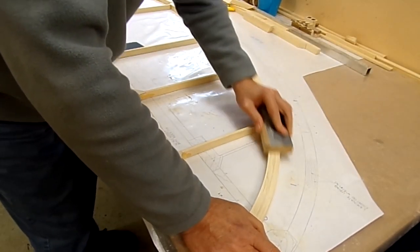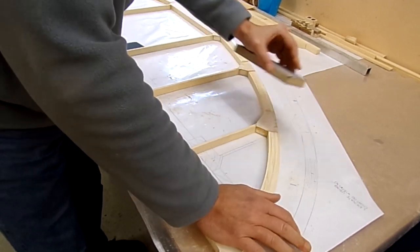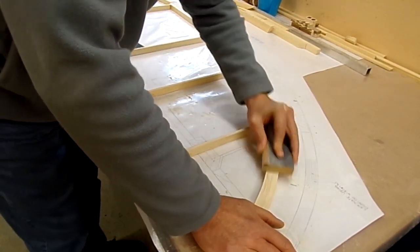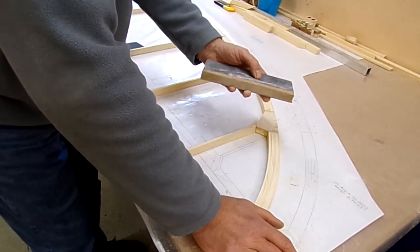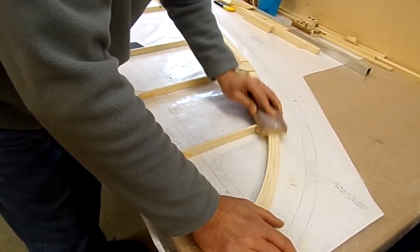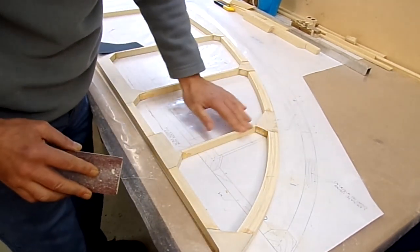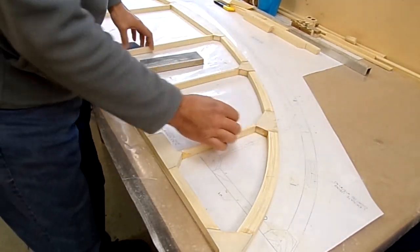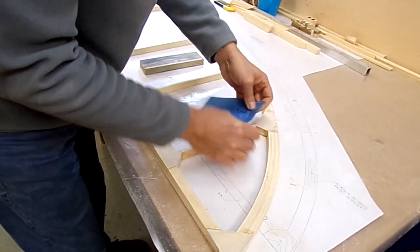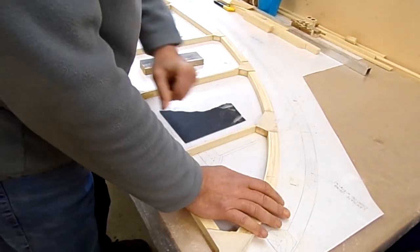Here we go — the other side, all done. I've done the edging with the router, and I'm just sanding down at the moment with 80 grit. Once I'm happy with that, I've got 240 grit on this side. Again, nice smooth — I'm just going to go over the rib like that, just to get rid of the little edges and bits, flatten out any lumps — just a 220 grit around the edge there.